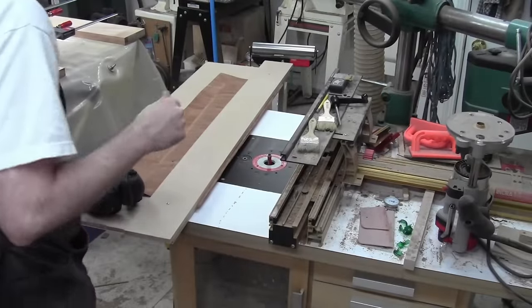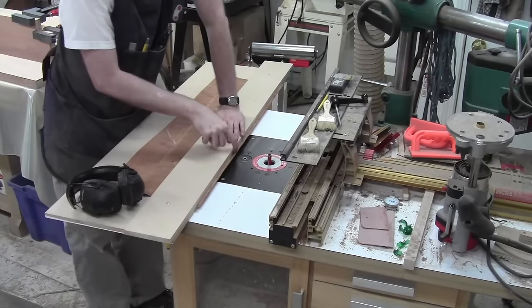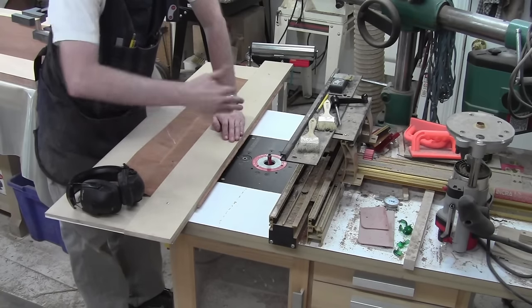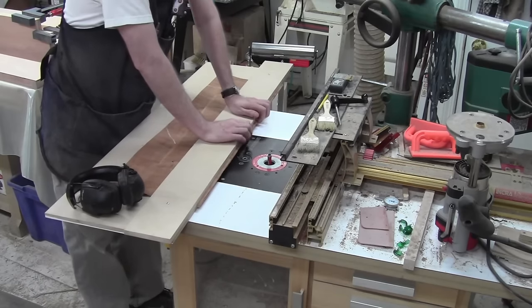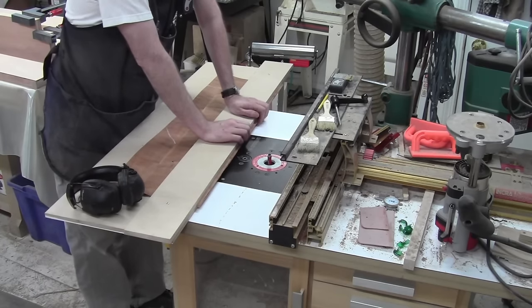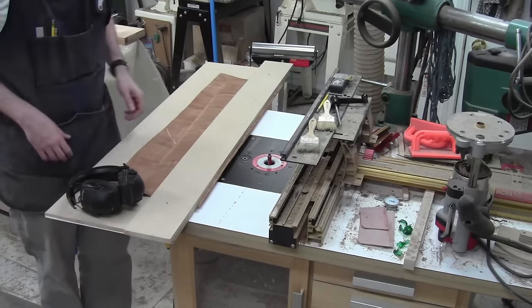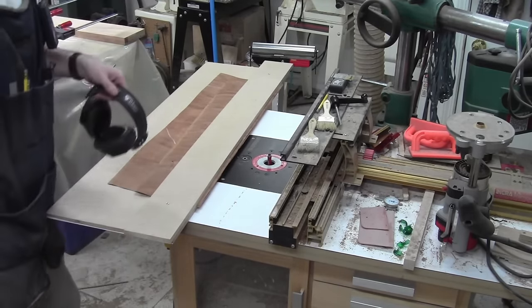All right, so what I didn't mention is the reason we do both at a time is that whatever happens, it's a complementary surface so that they'll fit when you open them back up. That's why I booked them together, and that's why we're only doing two at a time. It's complementary joints. So we've got a flush trim bit. We've got our jig. We're ready to route.